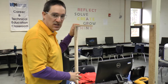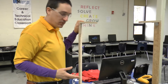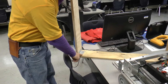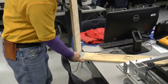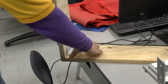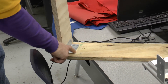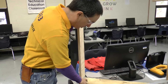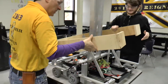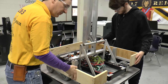This part of the bumper process is sort of the easy part because it's the mechanical part. What makes it easy for us is that we have these corner brackets that we've made in the off-seasons of previous years. This is eighth-inch thick aluminum angle, cut to length and drilled and countersunk with holes so that you can attach wood screws that go into the plywood bumpers. When these pieces are cut and assembled properly, this bumper will set down around the outside of our frame perimeter.